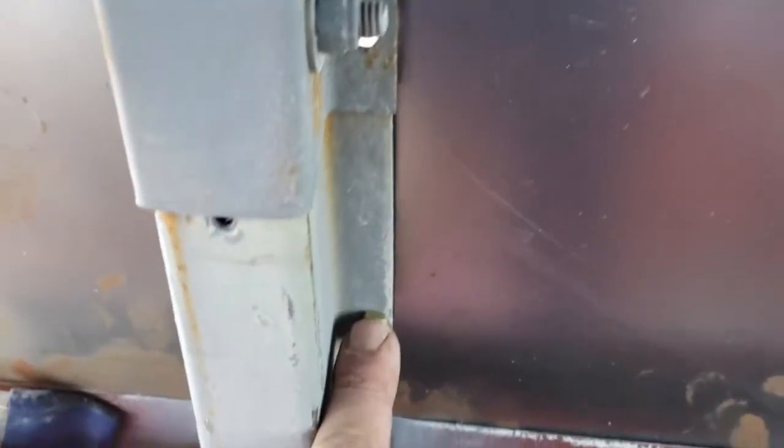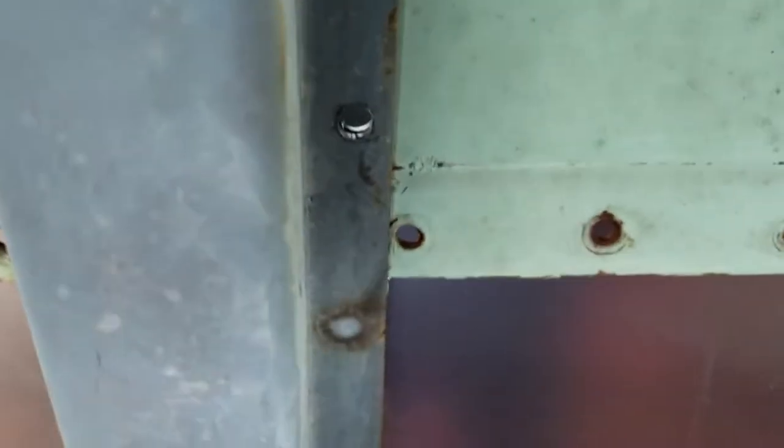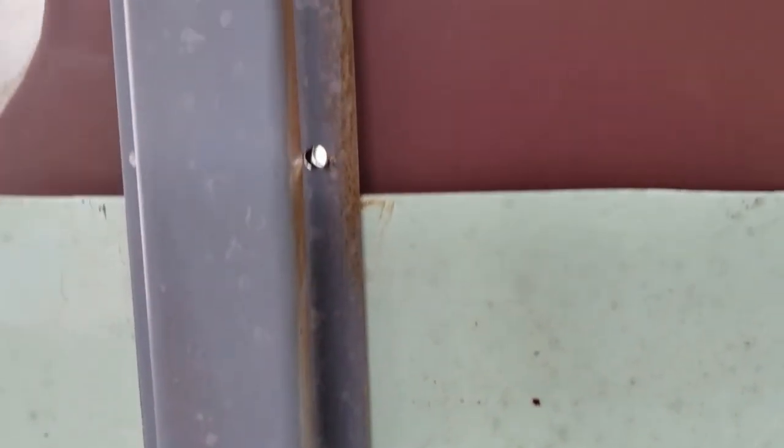Okay, so after drilling a few holes from the outside, this is the guide bolt here. You can see there's that hole there, came through at the right spot, that one as well, and so on. They're actually finding the right part of the hat channel from the outside. So that guide strip's working pretty well. Still got a few more to drill for that, but yeah, this is going to be quite the process getting these skins put on. Lots of work.